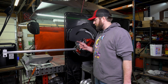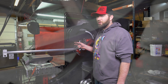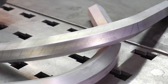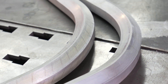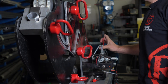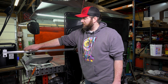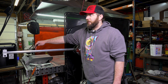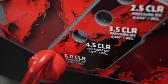So we are bending this inch and a quarter hex aluminum tube. This is our new inch and a quarter hex die. It does bend it on the flat — it does not bend it on the actual corners, but it bends on the flats. We are laying this out to do a bend. This material actually likes to crack under bending, so we're going to put the clamp block on, measure off our six-inch offset because we're on a six CLR, and then we're going to do about nine and a half inches because we're doing a 90-degree bend and it takes up 105 thou per degree of bend.